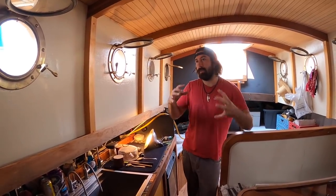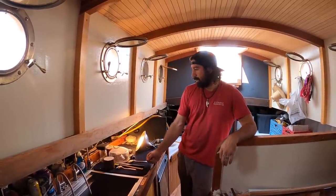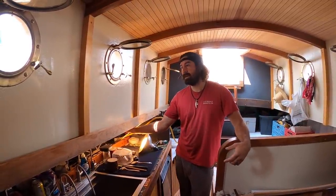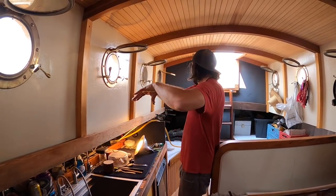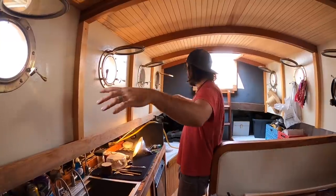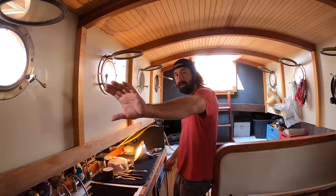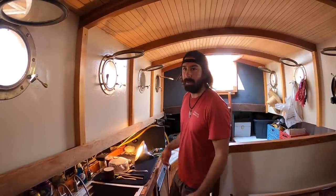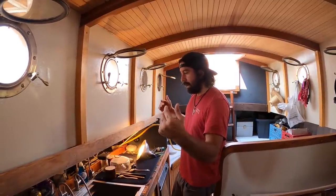When I rebuilt the cabin, I wanted to make it really solid and really strong, incorporated into the framing. So I put in these really heavy Carlins, which you can't see, but they're under there. They're basically big lengthwise structural beams that are tied into the two big beams that go across on each of the cabin faces, so they're notched and securely mechanically fastened into that as well.